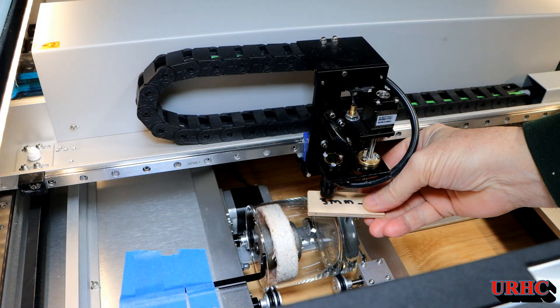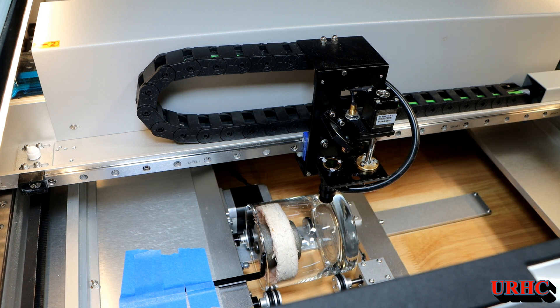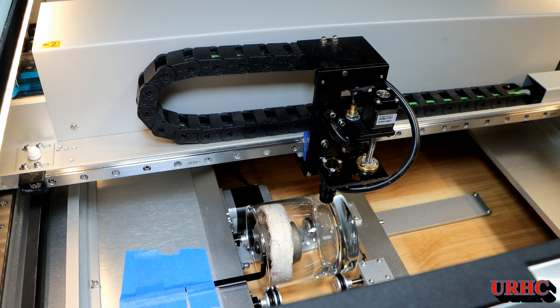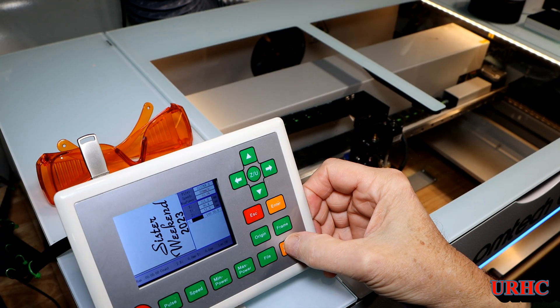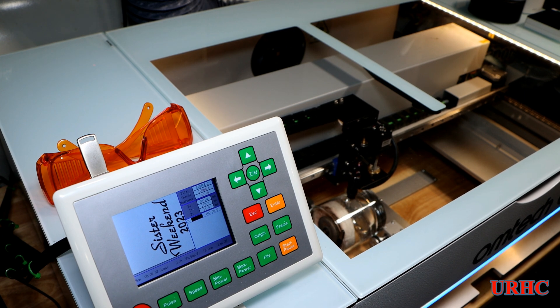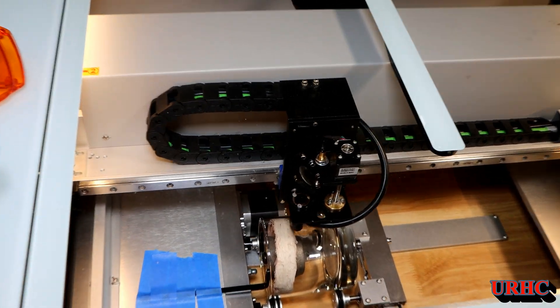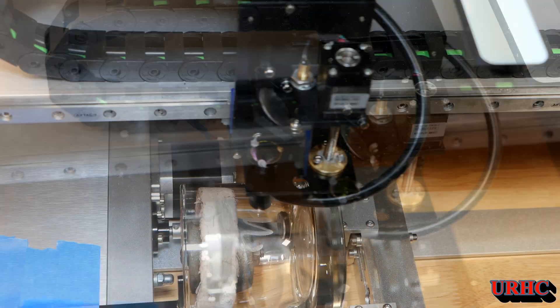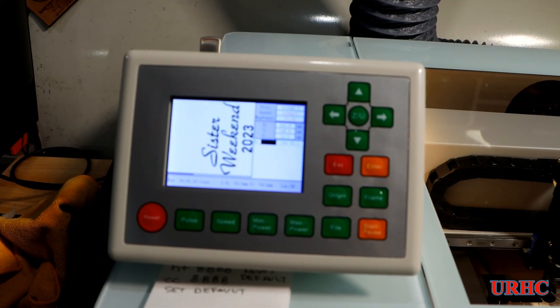Then you move the laser into line to mark for the number I'm using, then focus it. I'm using my controller, but you can do this in LightBurn with the down Z key too. I've uploaded my file to the controller, which makes it easy to repeat without the computer on. I hit start and I think I've got it now. I really did get a beautiful frosted finish without any really deep fracturing like I was getting on the blue diode lasers — they were making it rough and nasty. But with this one I was able to really fine-tune the settings.